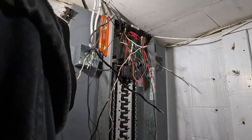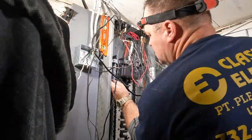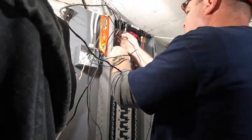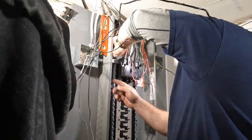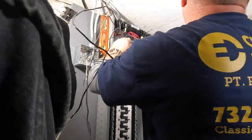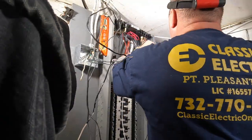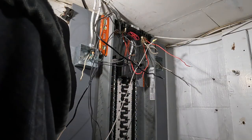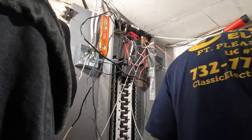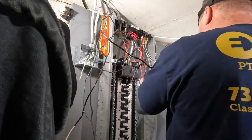This might look like a big giant spaghetti mess, and you'd be right - but fortunately I labeled all my circuits, so I know exactly what each one does. You're going to have black or red going to your circuit breakers, bare copper wire or the BX cable shielding as your grounds, and the white wires are always your neutrals. There's one crumpled-up red wire at the top - that's the way it was before and it'll be that way again. We're just going to leave it like that and cap it off.